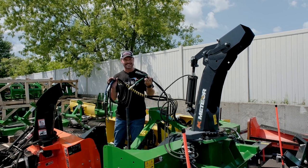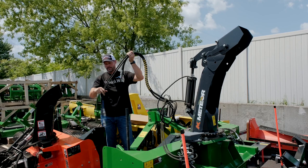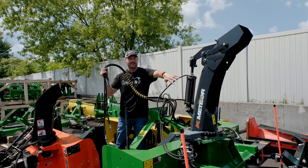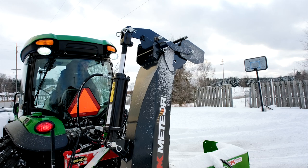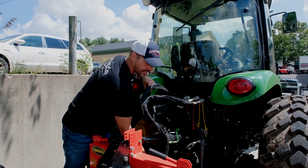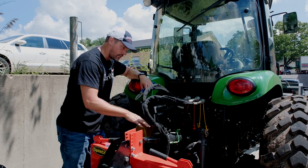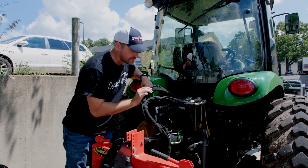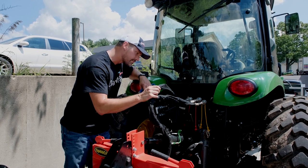There we go — got the identifiers and the tamer all on. You're going to notice the blue hose markers extend way longer and it seems out of proportion, but these two hoses are tied into the deflector which can spin around as a chute rotates, so they need that additional length. The hoses from my top and tilt have always kind of bugged me — there's a lot of exposed area especially down below near the PTO shaft. The Hose Tamer is going to provide better all-around protection down below, and we're going to do it up top as well and get these zip ties off of here.